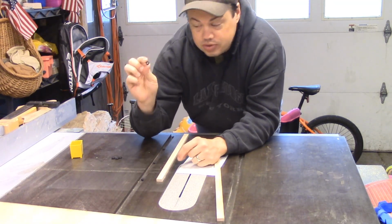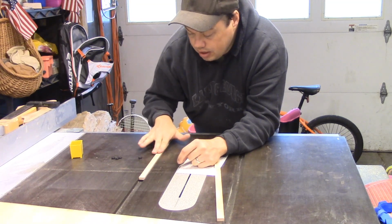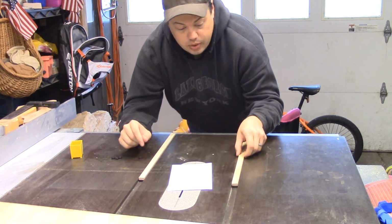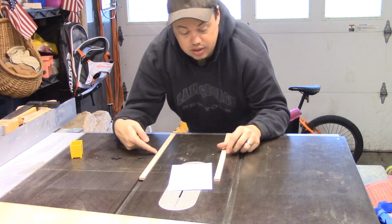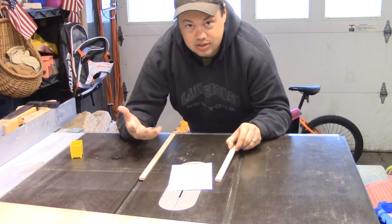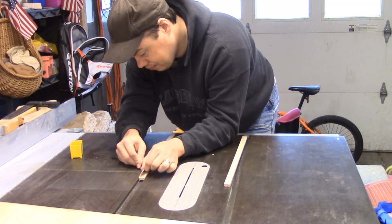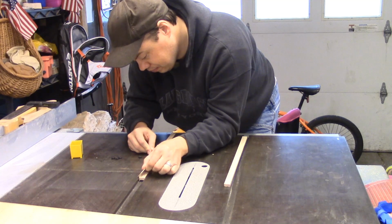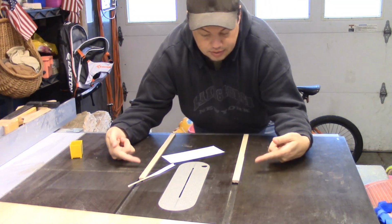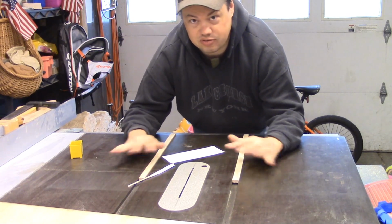And then I just got some nuts I drop in there. So when I put it down, it's above the table saw. Still floppy, but I've got an index card and a razor blade. And what I'm gonna do is I'm gonna wedge both of these runners to the inside using the index cards, so that they'll stay straight as it goes through after it's glued on. And that way, if it does expand and contract a little bit, because these are wood, it shouldn't bind. And you gotta make sure you remember to force them both in. Or you can force them both out, but not both one way, because then it would flop around afterwards.